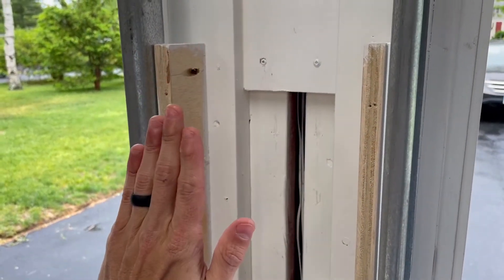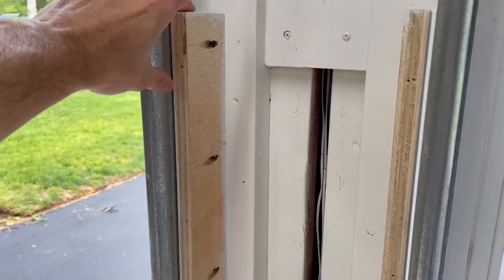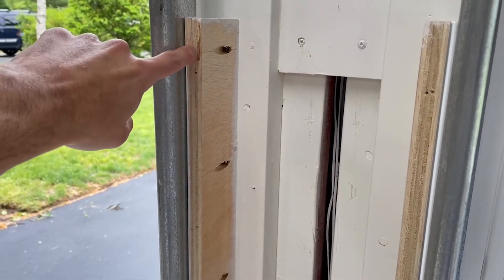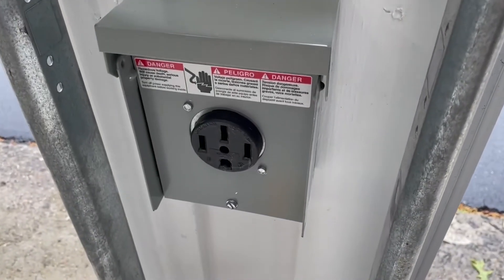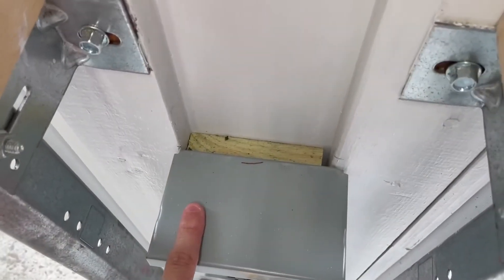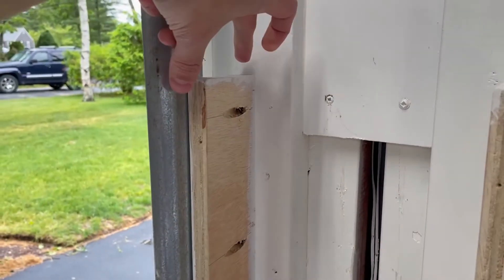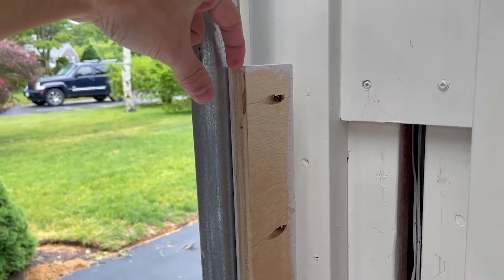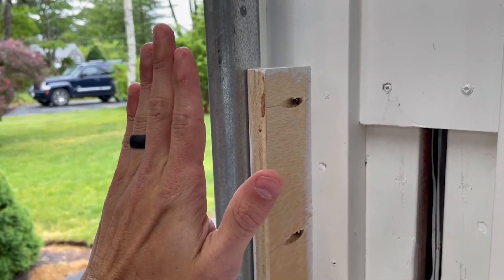The front panel is being screwed down these two edges, and these offsets are mounted onto the wall using pocket hole screws that you can see running down the edge. You can also see down here the NEMA 14-50 outlet, which also has a backer plate behind it. It's important that the length of this plus the thickness of the board itself offsets it so that you're at least flush with the track if not slightly sitting proud of it.